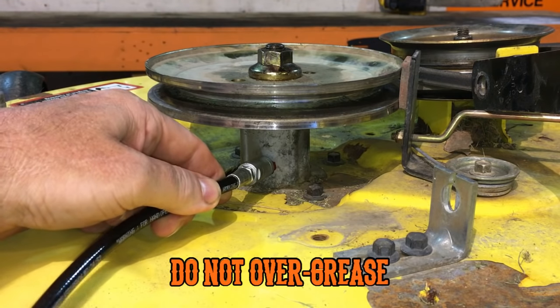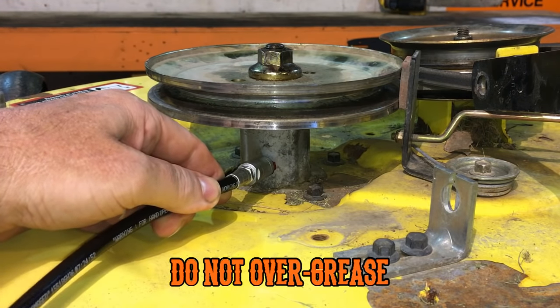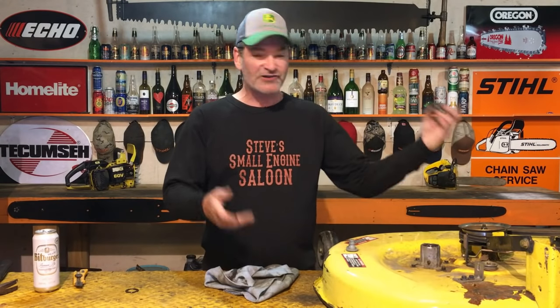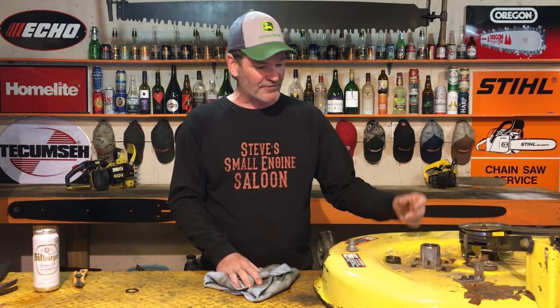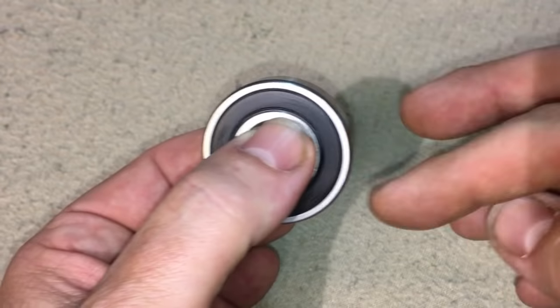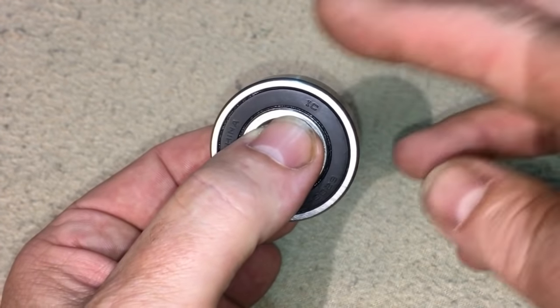It's now gonna grease your bearings. Pull that one side off, put them back on there, jack shaft back on there, put it all back together, and now you're gonna get a lot more longevity out of those bearings because now you can grease the suckers.